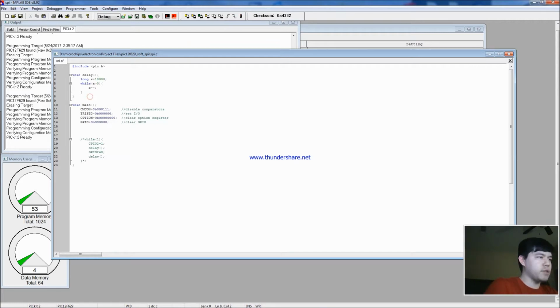So let's just make a very simple function called SPI. It won't have any return data. And we can set it, let's do an 8-bit SPI transfer. We can make the SPI transfer as long as we want, but we don't actually need any more than 8 bits for the purposes of this demonstration. A lot of devices are 8-bit transfer anyway, and it's easy to make it 16 or whatever you want.